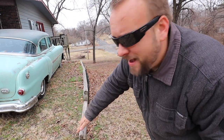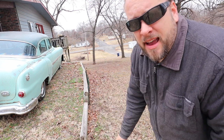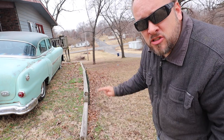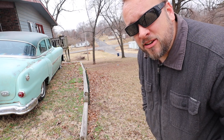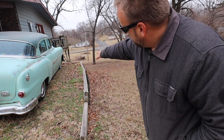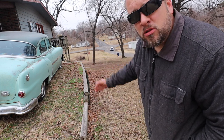Let me know what you guys think about this project. Now let me go show you that retaining wall issue. You can see that wall is bowing out and it's actually leaning quite a bit this way — it's on its way to falling. It looks like before we bought it, people drove these fence posts in because the wall was falling over. The fence posts are still straight up and down so those were put in after the fact. The house is over 50 years old and if the wood's as old as the house, it's all rotten — you can see it's cracked and splitting. I think I'm gonna dig all of this out, pull it all out, build a rock retaining wall, fill it back in, and give them back their third parking space.